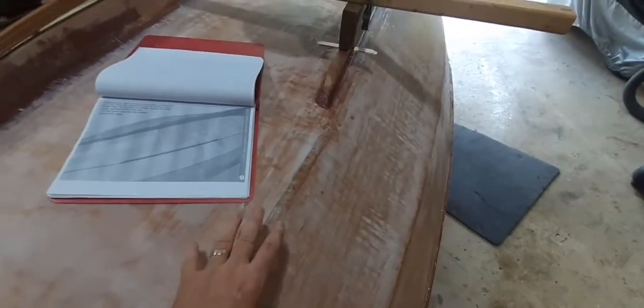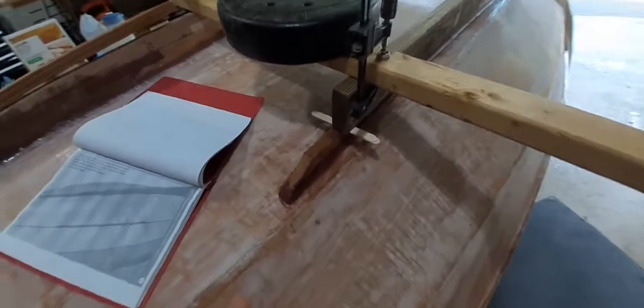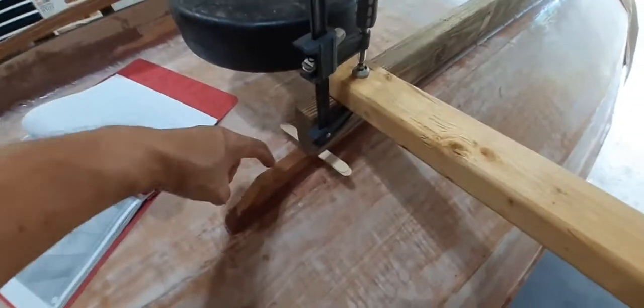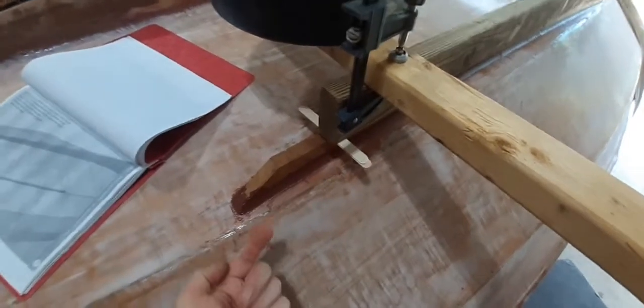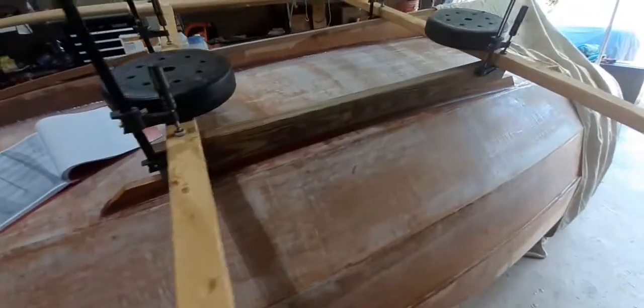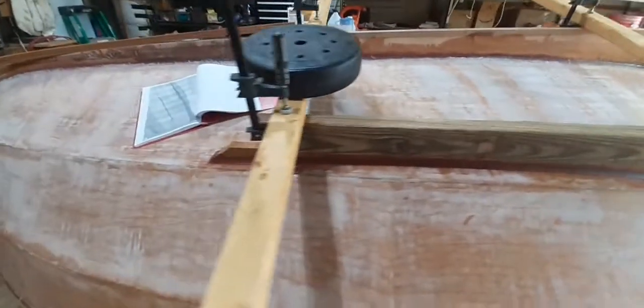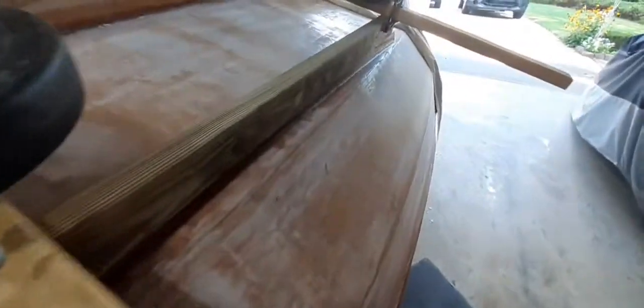As far as water flow, it's no worse than a curved bilge keel. I just put it down straight. This is the starboard side — it's already got two layers of glass on it and the bilge keel is now glued in place. I did not screw it. I was thinking about going down through the hardwood, but instead I skipped the screws and went with Easy Fillet, which is a structural epoxy adhesive and fillet material. It's already got stuff in it that makes it cling to all kinds of surfaces — upside down, right side up, whatever.